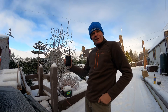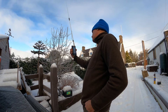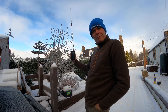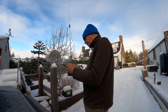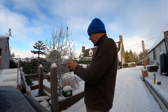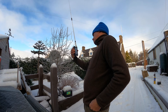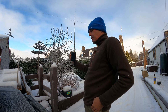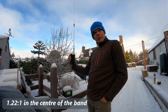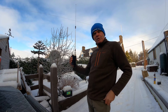Now on to the Chinese one. It doesn't actually like the counterpoise — the SWR has come up to 2 to 1. With the counterpoise removed, the SWR is 1.7 to 1. So there's quite a difference between the Diamond and the Chinese copy.